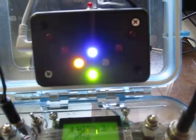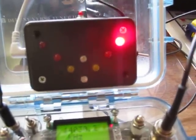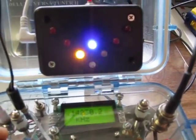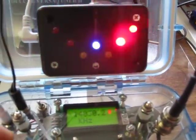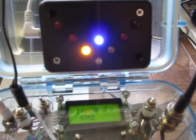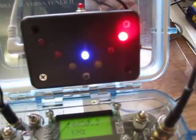Okay, so anyway, I just contacted him — a W9 station, probably in the Michigan or Wisconsin area. The blue light on the tuning indicator means that an audio signal is being detected, so usually it will flash with the code being heard. If it's lit continuously, that's not right — you have to adjust the RF gain and audio output so that it's flashing with the code. Then you just adjust the frequency so that the green light is being illuminated.